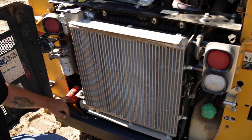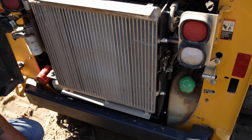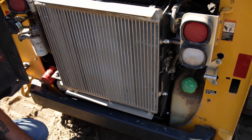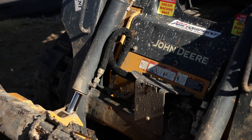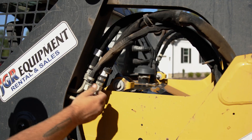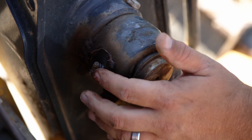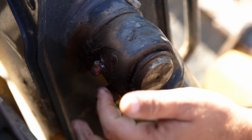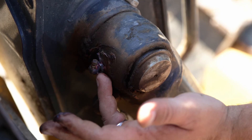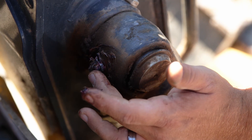After checking everything for leaks or damage, move to the right and you'll see a green cap — this is your fuel fill spot. Note that some skid steers have them in different locations depending on make and model, but nine times out of ten they are in the rear. After checking the engine compartment, move around the entire machine checking all hydraulic hoses and ensure all fittings are tight and free of leaks. When checking your grease fittings — which you should do every day prior to use — make sure there is a good healthy amount of grease on the outside. Refer to the owner's manual for the type of grease to use, and put grease in until it slightly protrudes out from the grease fitting.